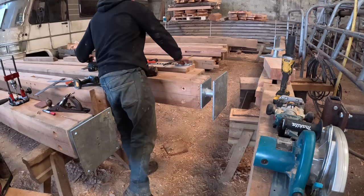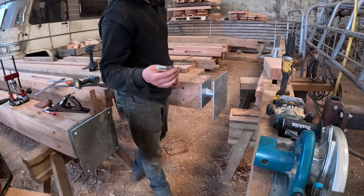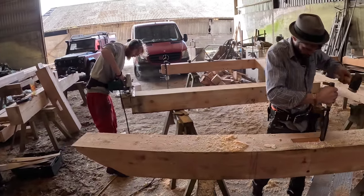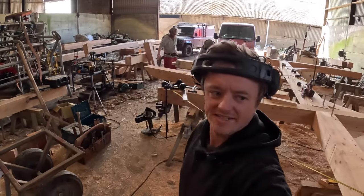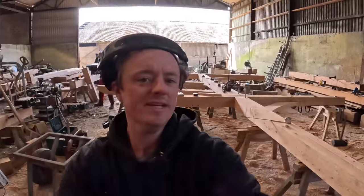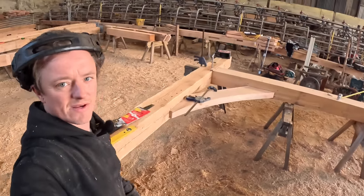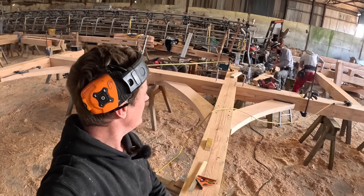There we go, that one's done. Until I get the proper bolts we're just poking these bolts through, but eventually I'll get the proper ones - this will all bolt together and squeeze all this together, all mounted hard to the foundation. It's getting late in the day. Howard and I are just starting - they just scribed up the post into the truss tie beam - so we'll be working on that tomorrow. There are braces still to fit and I'm going to get the other three post bases fitted while they do that.